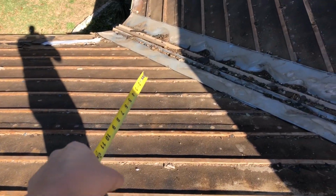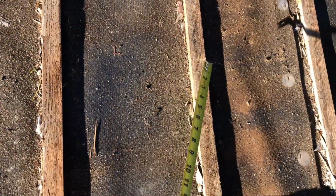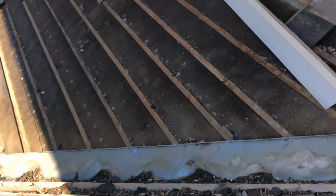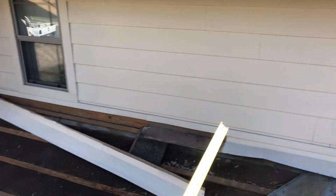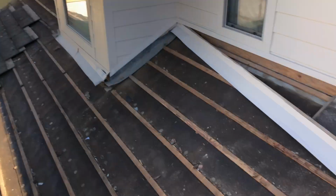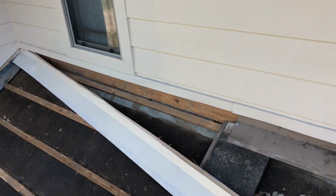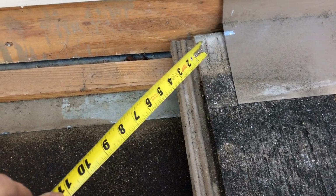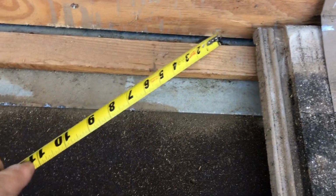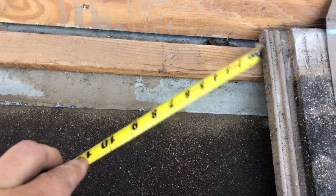So this is what the tile is held on by. It's called a batten system, 1x2, and your tile literally sits on this guy right here and hangs over. But back to the head wall. So some of the issues that you might run into here along this head wall, let me show you what you're going to run into is your tile. This is your concrete tile right here. It sits on these 1x2 battens, right?